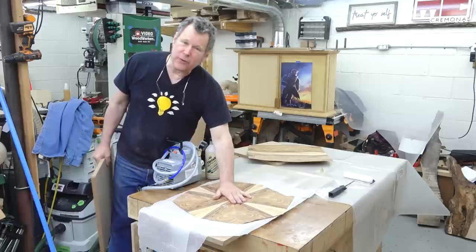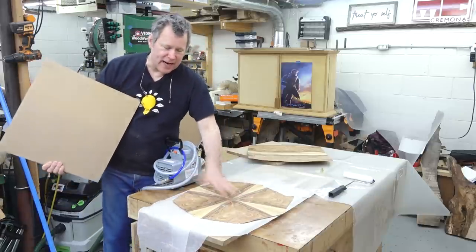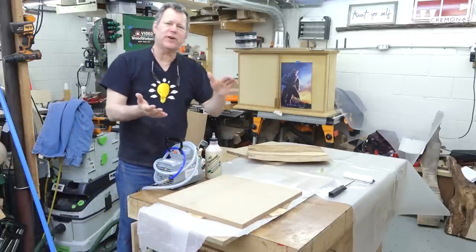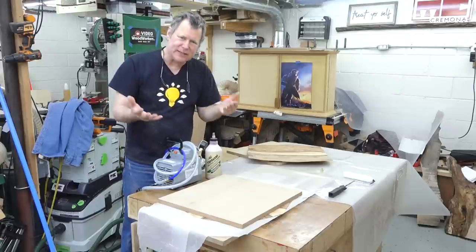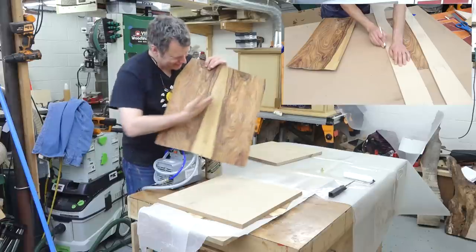Here, we're going to veneer both sides of our core at the same time. So I have my good face down. I'm going to be using my core. And what's very important is you always want to veneer both sides of the core. It's called a balanced panel. So we're going to be using a piece of veneer that Matt cut and seamed.